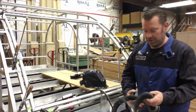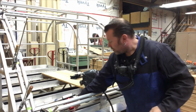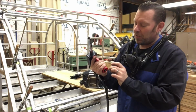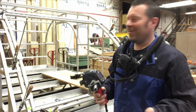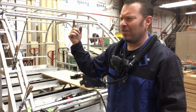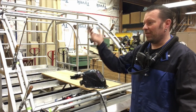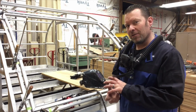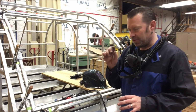I'm digging the new welder. It's really cool. Got a couple little quirks that I'm not used to. On the bottom of the gun, you can adjust your wire speed from the gun instead of the machine, which is really cool. But it's super sensitive, and every once in a while, if you're positioning yourself, you put your pinky down there or something like that. I learned the hard way yesterday. When I was doing the ones that are upside down, all of a sudden I'm like, why isn't it welding right? Anyway, I had hit the switch, and it had gone up to like 700 something versus 400 something. So I'm like, oh, well, that explained it, but I kind of wished I had a little cover over it so it wasn't so easy to knock off. And it's super sensitive. You just touch it, and it'll change.